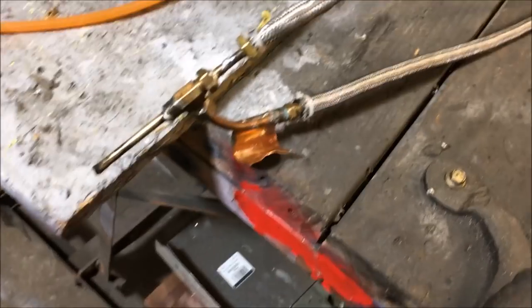This setup here is a siphon air nozzle - it uses an air compressor to pump oil. It doesn't have a pump; we just use the compressor to blast air through a needle which siphons oil through the pinstock. The problem with these units is that adjusting the air-to-fuel ratio is very touchy business. It's not something you can do on the fly easily - it can shut the system down. It's nowhere near as easy as systems that have blowers.